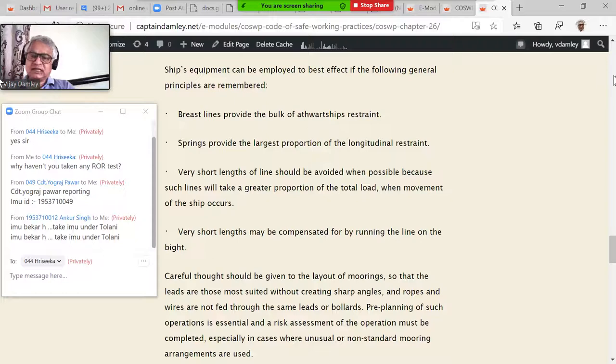Now the problem comes, you are doing it from height, so they dip down. So the dip angle is something one has to be careful about. If it is excessive, you are not getting the strength. You are going to work forces in 3D, that means three axes, X, Y, Z. So how much is the proportionate amount on the X axis, the proportionate amount on the Y axis is important. The Z axis is actually a wasted one, but we don't have options.